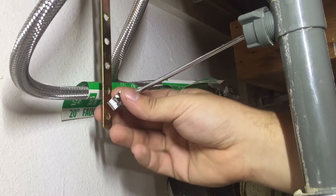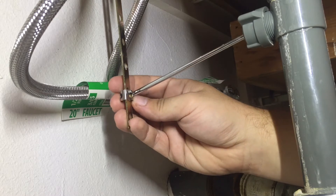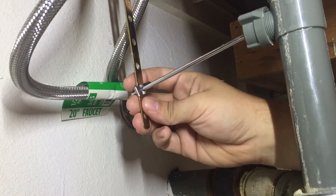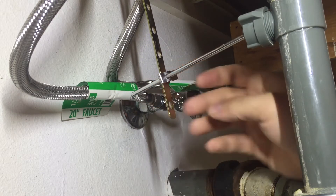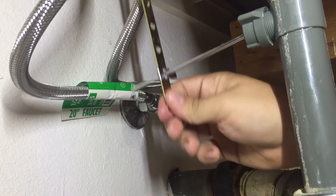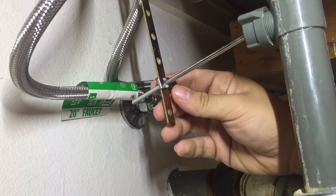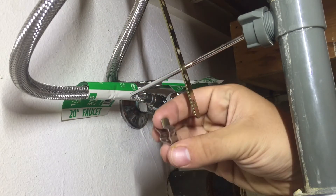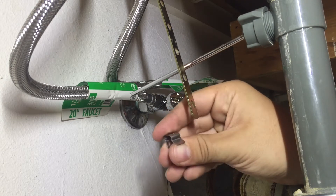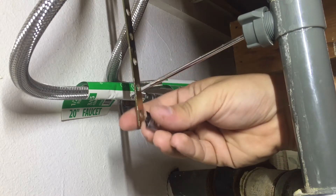What I want to do first is put the spring clip around the clevis bar through the hole we're going to use, and then finagle that pivot bar through it. The spring clip should hold everything in place as the clevis bar moves up and down. Sometimes the spring clip might be a little loose, so you can just widen it slightly with your hands to make it more secure on that pivot bar.